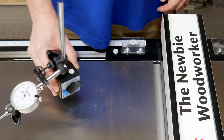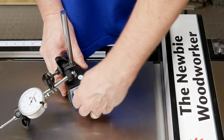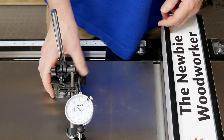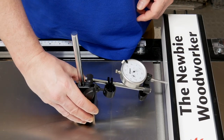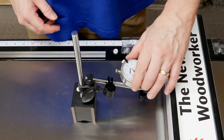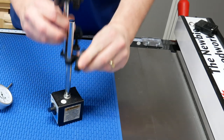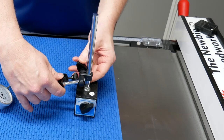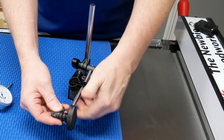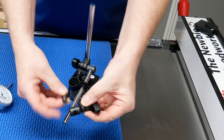The next solution is this magnetic base. I got this one for pretty cheap at Harbor Freight. Turn the switch to engage the magnet. If magnets stick to your tabletop, then this will stay in place. You use it pretty much the same way — place the pin against the fence and engage the magnet. Zero the gauge and you're good to go. Here's how you attach the gauge. Loosen this clamp to move the arm up and down, and bend it out like this. On the end of the arm is the clamp — loosen it and take it off. There's a pin here that should slide right out.